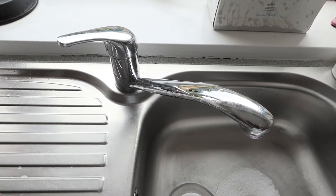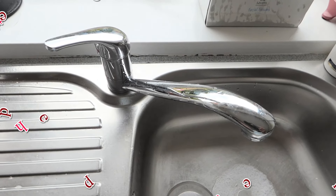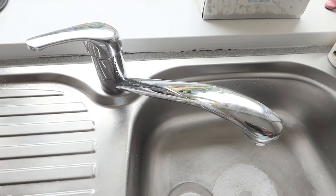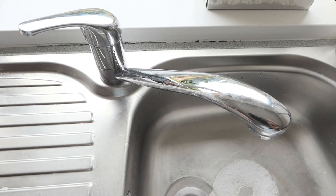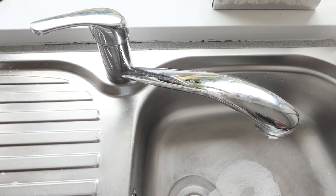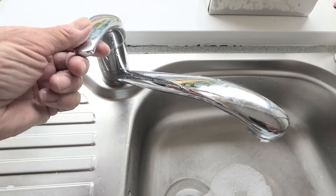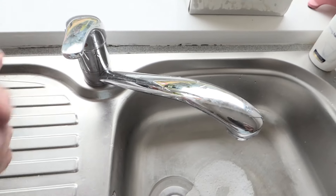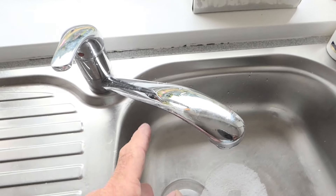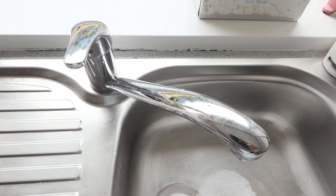Back to our mixer tap in the kitchen — what are we going to do now? If you're lucky and you've got no non-return valves on the supply pipes underneath, do check for those. You may have a slight hope because some of these taps will allow the water to go back around the other way. Some taps have got valves built in already that will stop you from pushing cold water up to the hot circuit, so it depends on your luck with the tap. This is well worth a try. Get your mixer tap halfway, get your hand under the spout, hold it as tight as you can, and flip the lever up. What that should do is pump cold water back down through the hot feed around the tap spout and back down, and with luck you should clear that air within seconds.